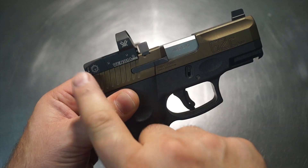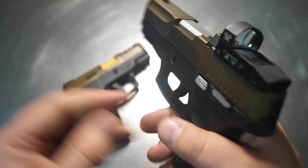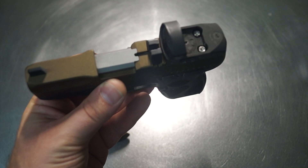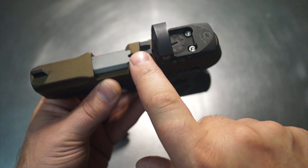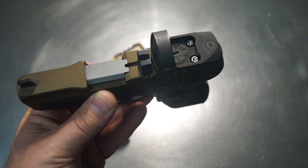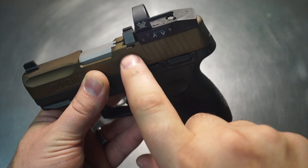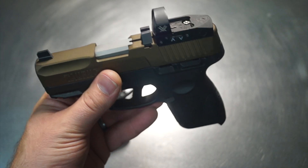This cut is to the rear of the slide — we removed the factory dovetail and cut a new Glock-style dovetail through where the roll pin is. We'll include some pictures; we tried to make that as seamless and clean as possible. We ended up cutting through the roll pin. One other thing to consider is that we have a channel inside where the loaded chamber indicator was. Under normal circumstances, if we just did an optic cut without a front-of-optic dovetail, it would leave a small cut underneath the optic allowing dirt to get in. By cutting that dovetail in the slide, it actually seals off that channel so we don't get dirt and grime from the barrel area up underneath. So the dovetail actually seals that off.